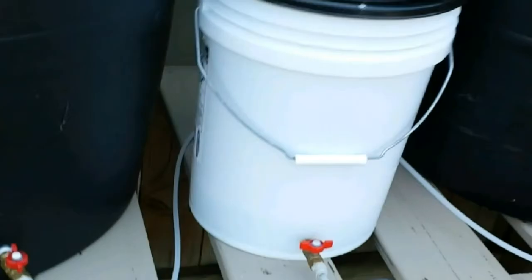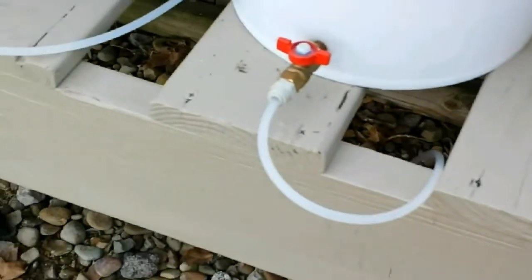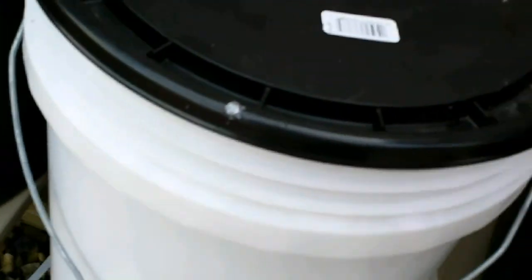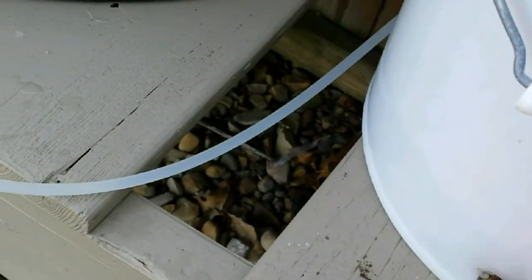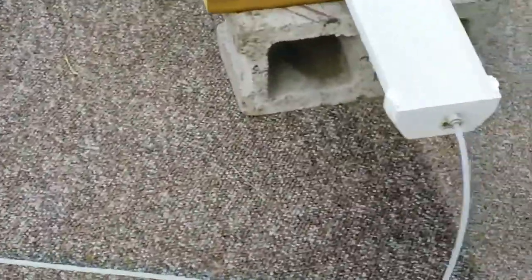And then I'll show you, these valves are on now. They're feeding into where the float valve is. And the float valve is basically just going to, as the water level goes down, just like a toilet float valve would do, open up and let this tank fill back up again. I'll turn this on real quick for us here. Now, as I turn that valve on, the water is going to come in through these lines, and I'll show you how it works.